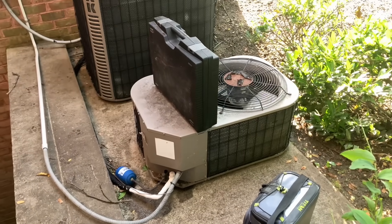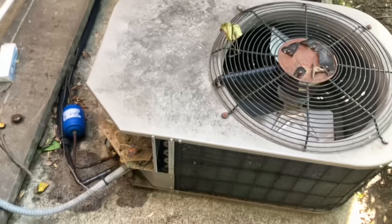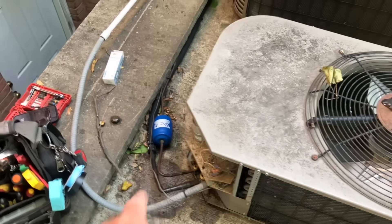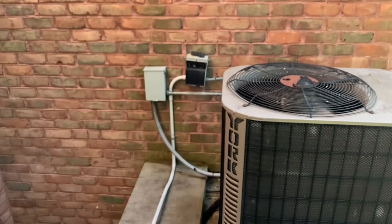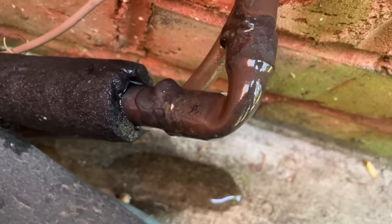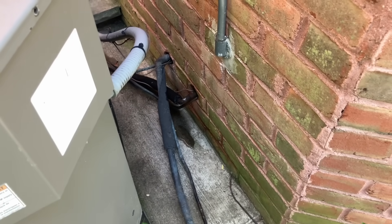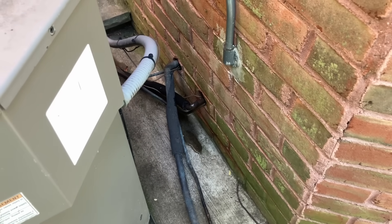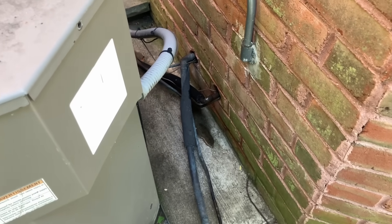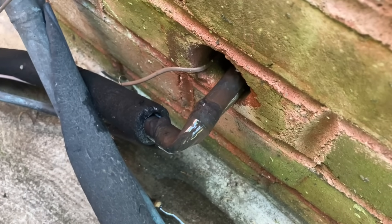Let's hope that leak's not in the line set. I have my refrigerant — whatever was remaining in the system — pumped down into my condensing coil. Compressor was being cooperative. While I was doing that I'm looking at the line set, looking at the electrical whip, especially that disconnect, and I'm noticing that it's five-eighths. We're going to get a little creative with that. But more importantly, take a look over here — that is the kinked line, not only on the five-eighths but also the seven-eighths. You can't make this stuff up, folks. Absolutely incredible what you come across — just hacks who literally don't care.